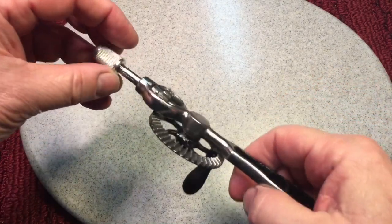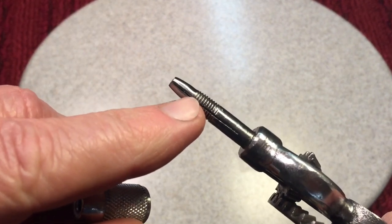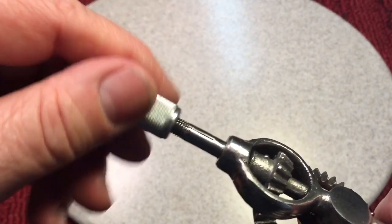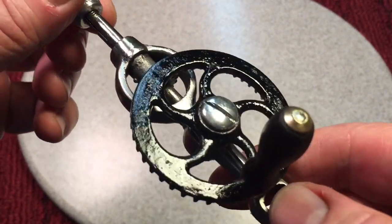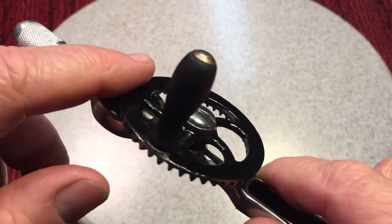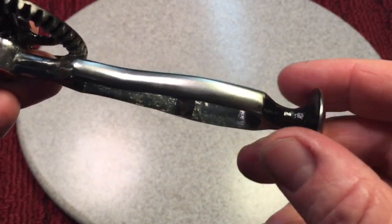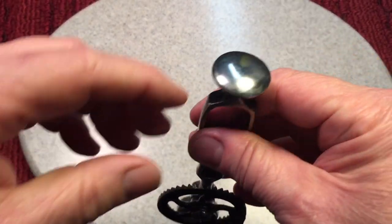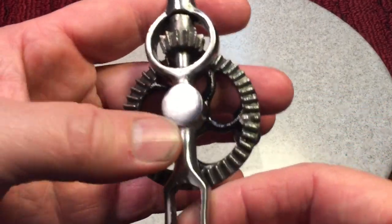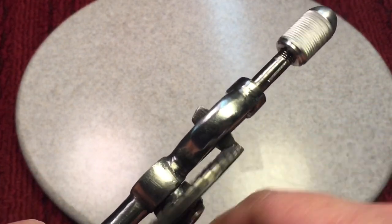This was a big transitional part. Here's the chuck we made — just a simple chuck. What's so nice is this is a standard quarter-by-28 thread, so it was very easy to make up a little chuck that closes the three jaws around the drill bit. We painted the traditional black on the spokes and on the outside, polished out all the rust, painted the inside black, and painted the bottom black. Look at that — how nice is that? If you were to see this at a flea market, you would never think it came from the sea of rust it looked like. Look how smooth this works — can you hear that? It's just so smooth.